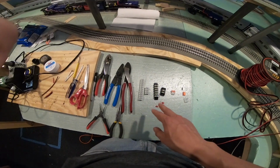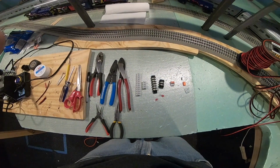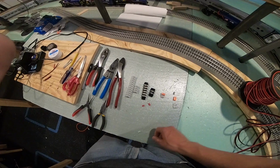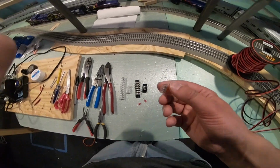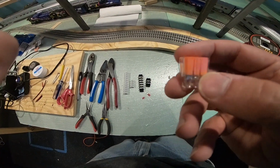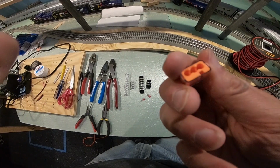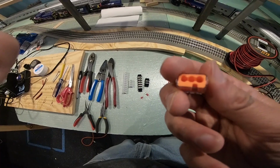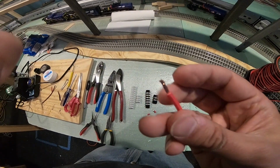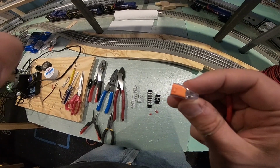Now, all these have some sort of cost associated, these being the cheapest without requiring connectors, these being more expensive, requiring connectors. Then I've also found these which are Insure connectors, which are nice, except they don't work with the loose wire that we typically have on the end of the connections. These are the stranded wires, and these do not go through. These are designed for the solid copper wires.